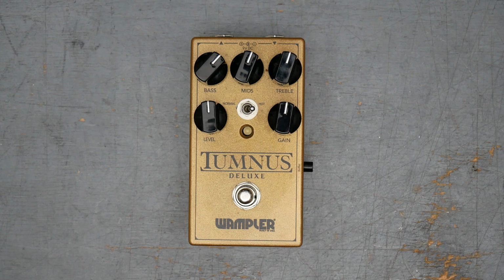We're probably going to see op amps and then hard clipping diodes as part of that overdrive circuit that lives inside that clean bypass. But there's probably significant changes to values here and there, capacitor values, resistor values, to give it a different sound or tonal quality that Brian thought was an improvement over a Klon, presumably. At least that's probably why you would make a pedal out of it.